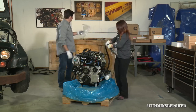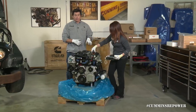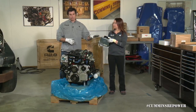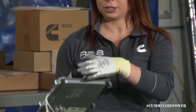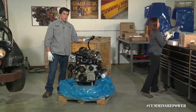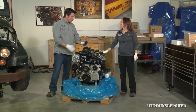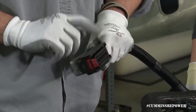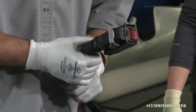Simply undo that clip, getting that ECM out of the way and putting it in a safe place during your install — so you're not welding or grinding anywhere near it. That's your central nervous system for this engine. There is no cap for the connector port when you take it off, so make sure no moisture, dirt, or dust gets in there. If it's going to be a lengthy install, it's important to protect this — you have all these small pinholes that could collect dust and debris. Recommend putting a plastic bag with a zip tie to keep it nice and dry and dust-free.